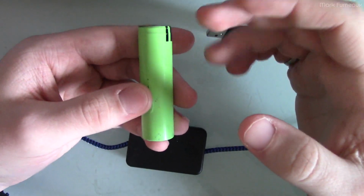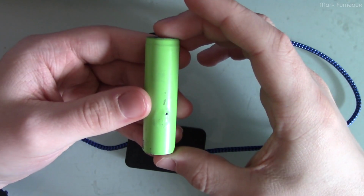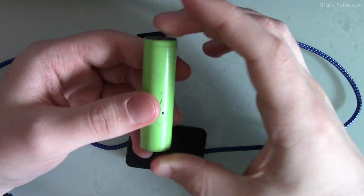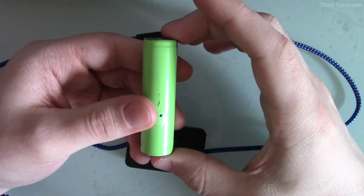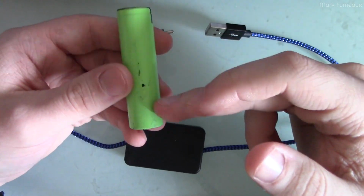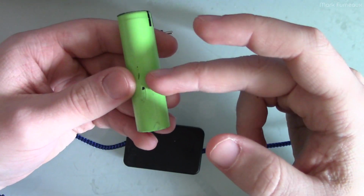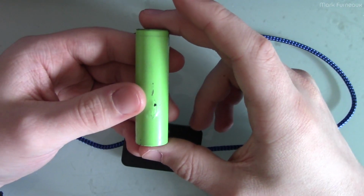If you don't have that, sometimes you can root your phone. You can put custom software on it that'll allow you to do that. Your options are going to be determined by what hardware you have as far as the upper limit of charge. But if nothing else, just avoid doing a deep discharge if at all possible.